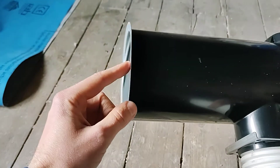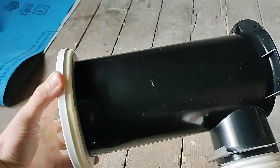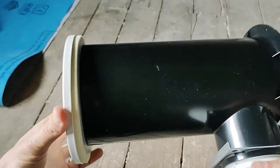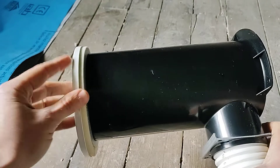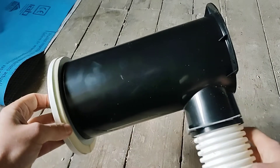Once the socket is inside, your plasterboard final layer is here. This is just poking out on the line of the plasterboard, and then the room valve will fit in and it screws into place like so. So all that's visible on the plasterboard side is this room valve, and everything else is within the wall itself.